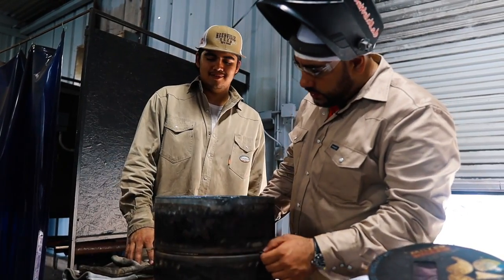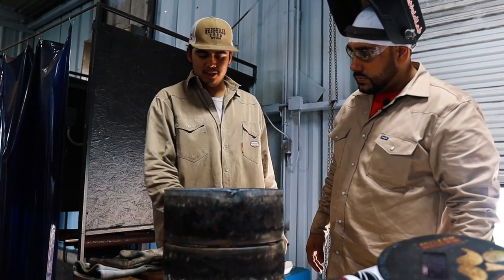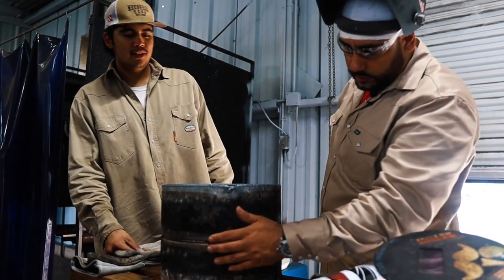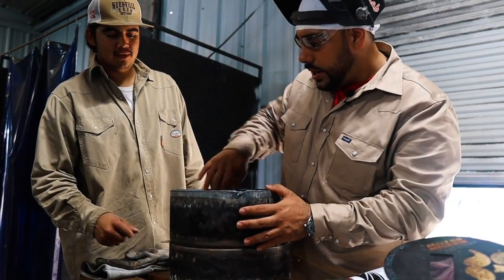This is a nice space you got here. What size space should you have? It's a 16th. A 16th — definitely what I like for the downhill root passes, a 16th. Probably a 3/32 land on there. A 3/32 land, 16th-inch space. Make sure we ain't got no high or low.